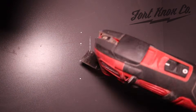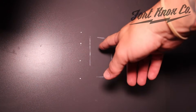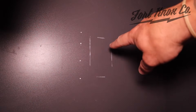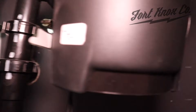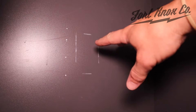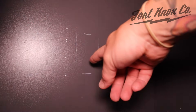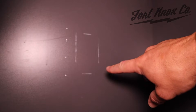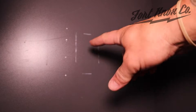I'm going to take my oscillating multi-tool with a straight cut bit and cut right on the inside of these white lines so I don't overcut. There's only so much room on the outside of these old work boxes, so I want to go small first. I do have some water lines over to the left, so I want to be careful. We've got about half an inch to three-quarter inch of cabinet material, some drywall behind it, and I believe there's also some OSB board behind that, so we're cutting through a couple of different layers.